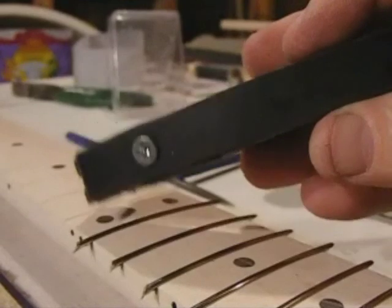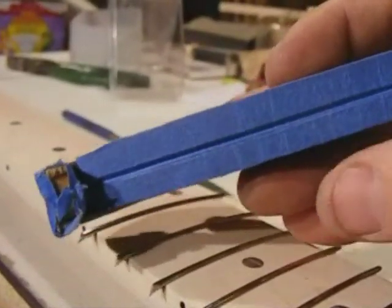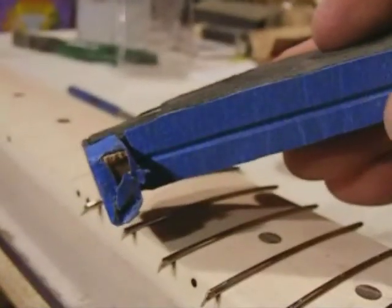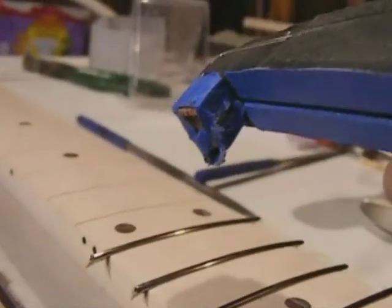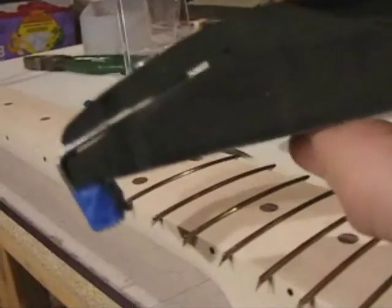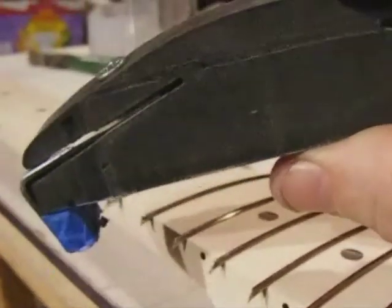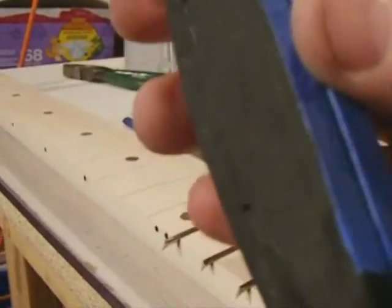This is a piece of — I think it's about three-quarters inch thick — it's just a rubber sanding block. I filed a groove to a depth that would fit the crown. This blue tape actually aids in sliding across the neck, and it keeps any rubber from going onto the neck. I just have a little bracket that I modified and screwed in there, and a little block to catch the end of the fret. I thought I would use a jig to pull it across, and so there's an eyelet there, but I don't use it. It works pretty good. Because of the compound radius, I need to conform to each fret radius, which would be different, so the rubber seems to do the trick.